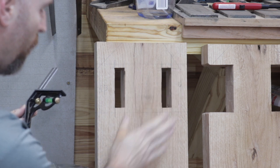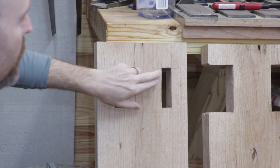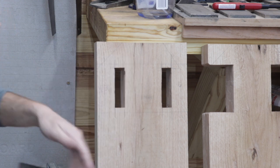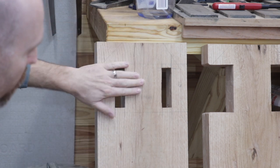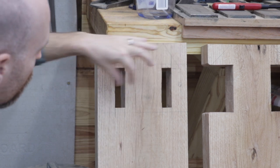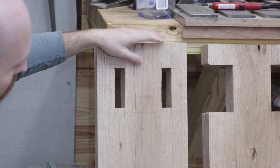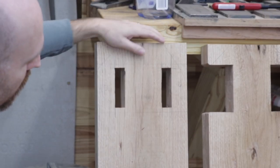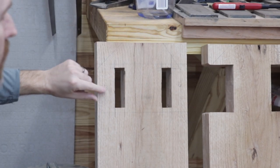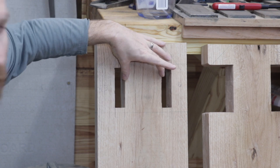This is the number three upright — the first one that we cut the two mortise joints in — that house the two ways, the two horizontal pieces that connect each of the three uprights together. In order to transfer the marks from this board to the number one upright, I wanted to assure that the joints were exactly the same distance from the reference edge on each board. These two uprights are slightly different in width, but all I was concerned about is assuring that the joints were the same distance from the front and the same distance from one another in the middle.